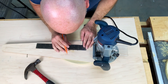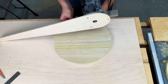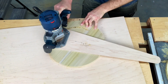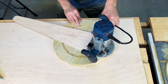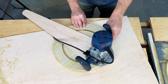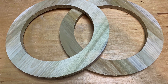I wanted these rings to be about two inches in width. So I adjusted my circle jig two and a half inches from the initial starting point. I added a half inch to accommodate for the actual width of the router bit. This is an inside diameter cut, not an outside diameter cut like before. So round and round, the router goes in a perfect circle — because of my awesome circle cutting jig. What I did to one, of course, I did to the other.